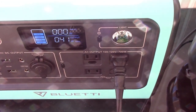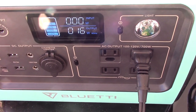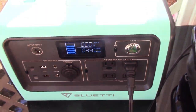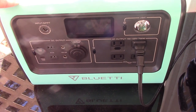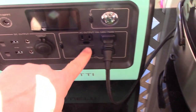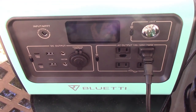Only a few minutes left on the rice cooker. In the beginning it went as high as 350 watts, but that's just to get the rice up to temp. Now it's cruising along somewhere between 15 to 50 watts. Still over 80%, so pretty good so far. The Bluetti uses a lithium iron phosphate battery — the new technology that handles massive amounts of charges before going bad. It's got a DC side, AC side, and a little emergency light. These can be charged at 200 watts input.